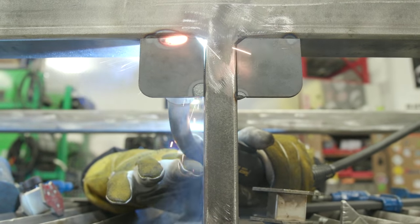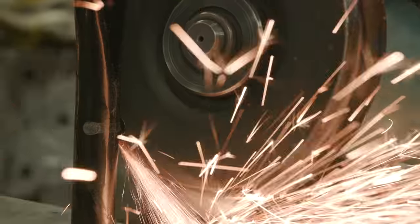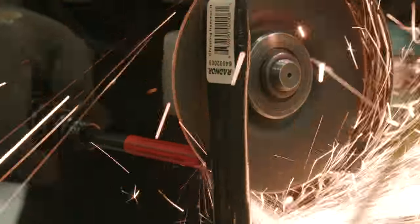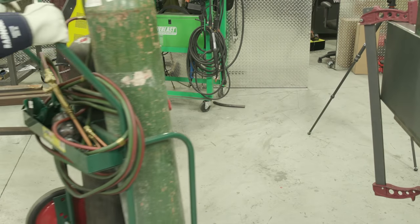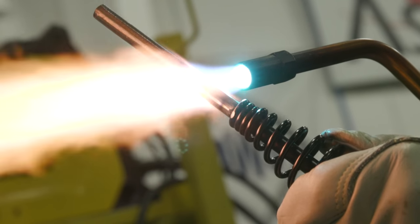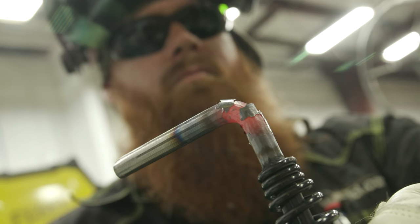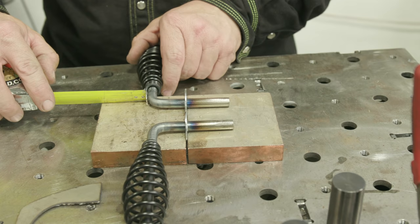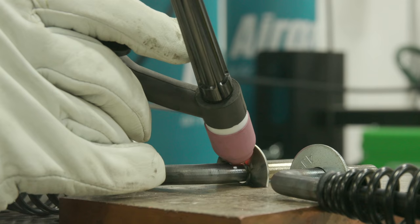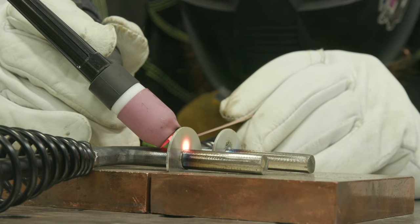All right, so you may have noticed we have handles for the vents, but we don't have any handles to latch and close the door. So that's exactly what we're doing here now. Took another couple of chipping hammers, cut the heads off as far back as I could. I've drilled these washers out and spaced them out far enough to where your hand will be able to get through there when these are up against the door. So this is basically gonna stop it from going too far in. On the backside, we're gonna put some other stuff to be able to build a latch on here. But for right now, I've got these washers on here. I'm gonna just tack these in place. Stainless steel washers, steel handles. We're just gonna put a couple tacks on here just to hold them in place.